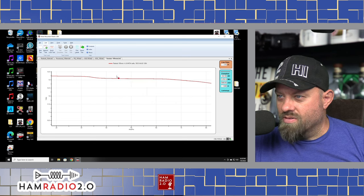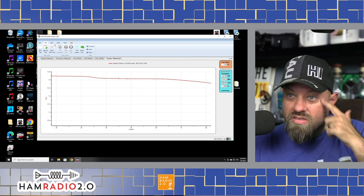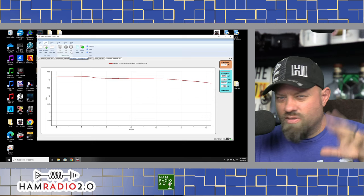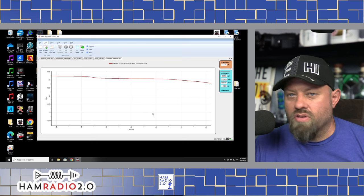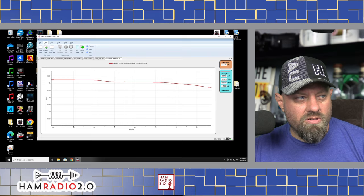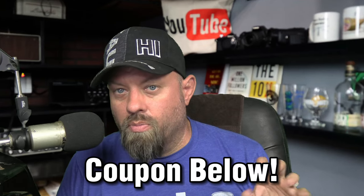I bumped it while it was running — right there — and it acted like it was going to stop, meaning I'd have to start the test over. But I paused the software. While the test is running, there's a pause button — you can pause, stop, or start the test. If you stop it you have to start over, but pausing preserves progress. I reseated my connections and started again, and it kept going. Hats off to the CBA5 software from West Mountain Radio. RedOdo comes in with flying colors — check the links in the description below for the battery and the current coupon code 'ham radio' for four to five percent off.